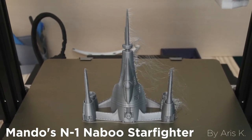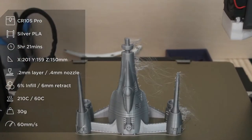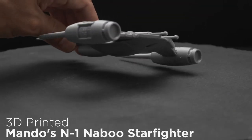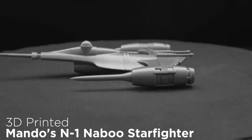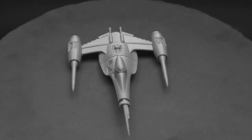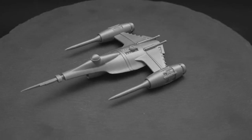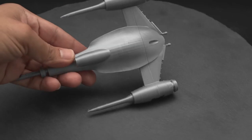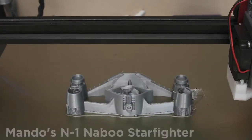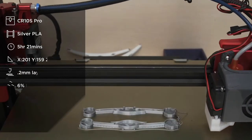With the split approach those melting tip issues go away. There's extra retraction visible in the time lapse because a large amount of filament got stuck between the extruder and the fan nozzle. Always look over your printer to make sure there's not a bunch of PLA building up. The time lapse method also requires the print head to park and the camera has a delay timer, which is why there's stringing and why it takes forever to print.